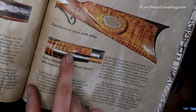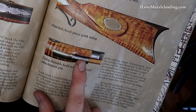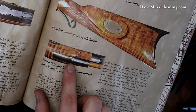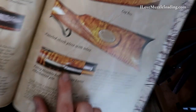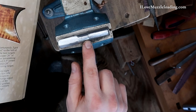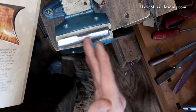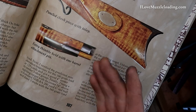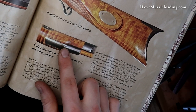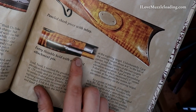You can see that this is round as we go in, but we do have a wedding band here in between these surfaces. When it comes to some of these things, it's easier to put that wedding band there than it is to attempt to make this smooth all the way across, because you have limitations of your files, of the maker, and just the physics of the shape of the part. This is kind of what I suspected — I suspected we might have a wedding band there to mate these two surfaces. So we're going to see what we can do with that in mind, to maybe put one of those in and see where we can go.